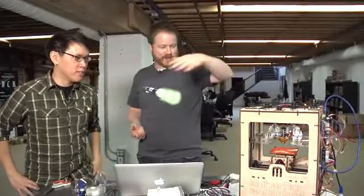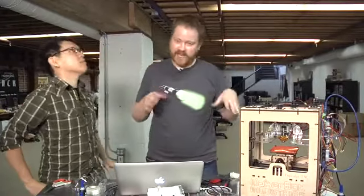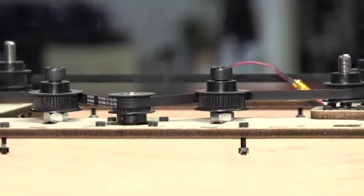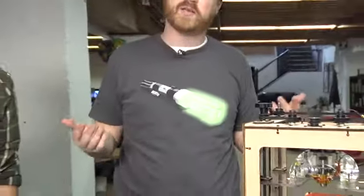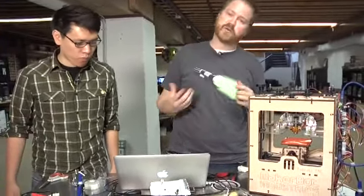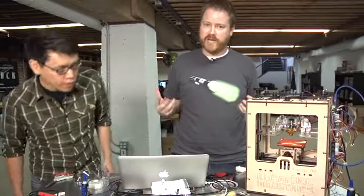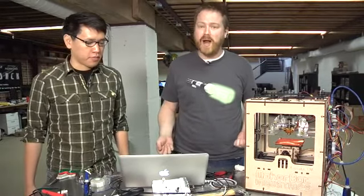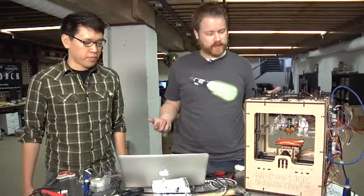We're back — the MakerBot is warming up. Smells like brownie. Do you smell what the MakerBot is cooking? What's happening is the grease we used to lube up the plastic shaft is burning off the heater — this is to be expected. You can see the smoke. One thing to note is the Mark V takes a lot longer to heat up because the resistors are bigger and there's no nichrome coil around the barrel, so there's more mass to warm. It's been warming up about five or six minutes and it's only at 186 degrees — we're shooting for 220.